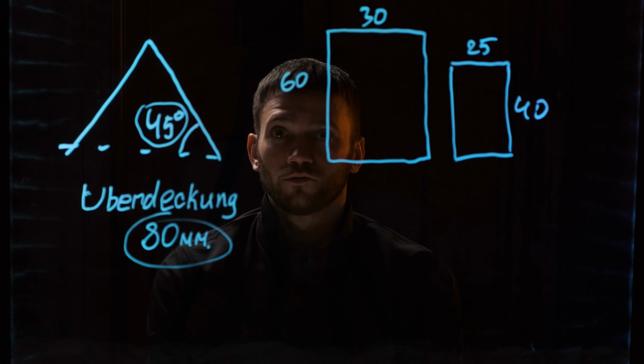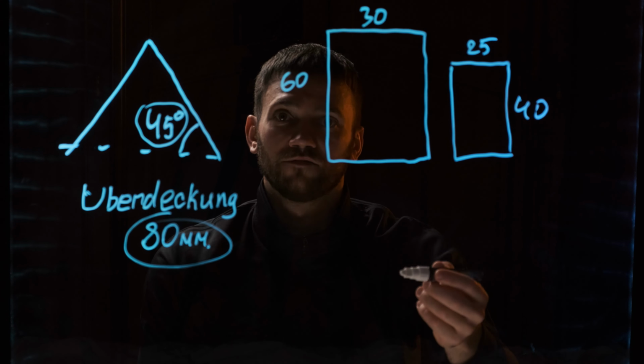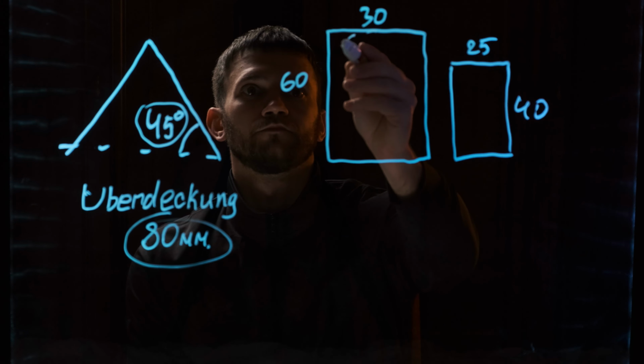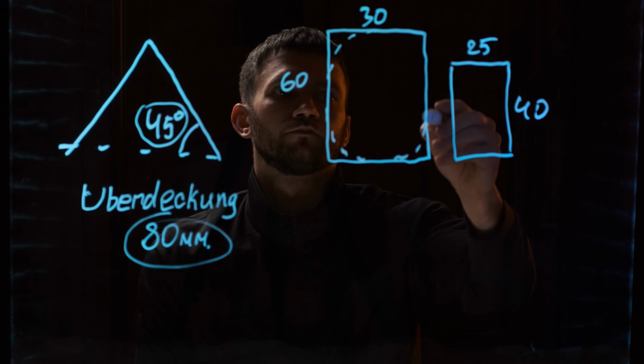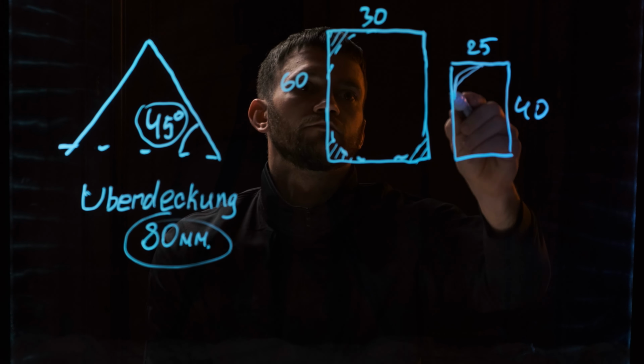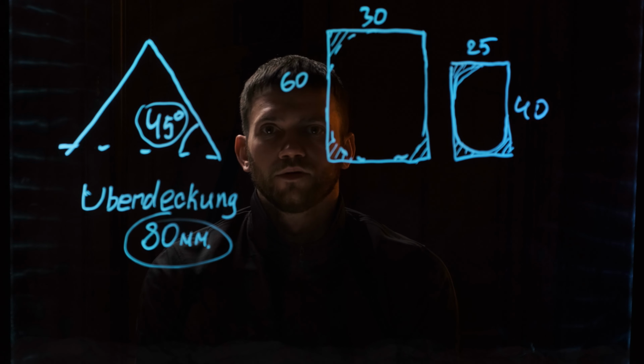So, before we start laying slate on the roof, we have a lot of work to do in pre-treatment of the stone. Your guys, if they are completely beginners, at this time will work out the technique of manual stone processing. After such training they will become professionals. We need to round off the rectangular format, leaving just one corner intact. Approximately half of the right and half of the left stones. This is how we treat each stone.